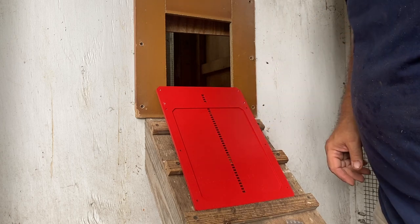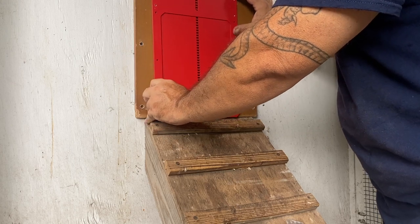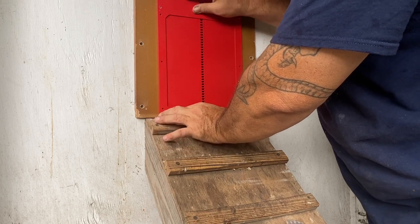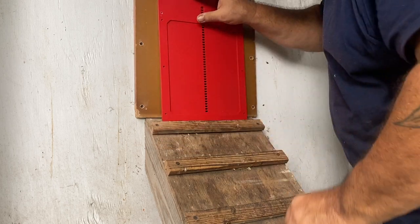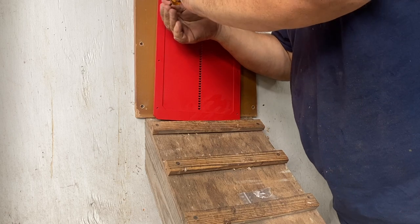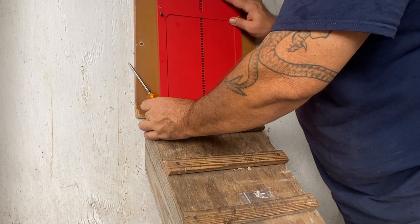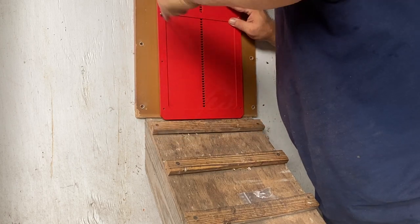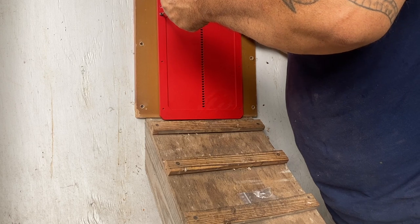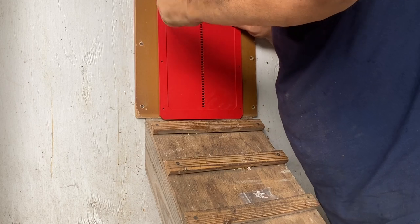You just put it where you want to mount it. I'm centering it in the doorway and then you're just going to screw right in here. Probably should have pre-drilled the holes into the wood. I'm also using particle board because it is protected, but it is going in really easy. So you screw it down and then you just back it off like a quarter turn — I think it tells you to leave like a millimeter of space.